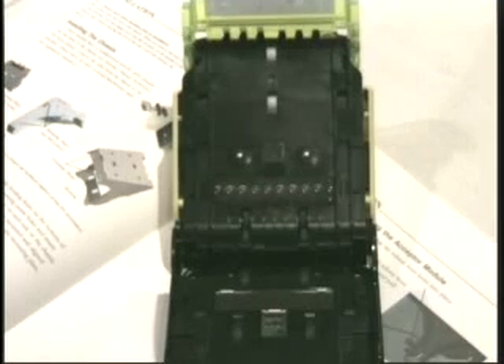If you have two windows, how come we don't have to put the voucher upside down so we can see them in the window? The answer: with the dispute resolution window setup, you wouldn't see the barcode or the validation on it anyway. MEI is only using one reader per unit — they're not putting them in both — but they give you the option. If you need to change to an up stacker, you can flip it and put the barcode reader in, and then you'll be able to read the barcodes. As far as a regular ticket with the dispute resolution window, it's not so good for tickets — it's more set up for bills.